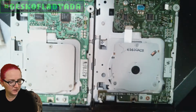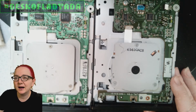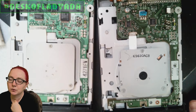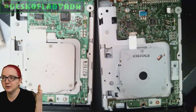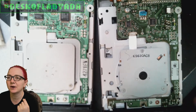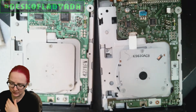The seller of this was like, no, I tested it in the computer. And I'm like, well, I believe you. But I would like to have this floppy drive supported. So what I'm going to have to do is find or get some computer with a floppy interface, and then verify it works. Just try inserting a disk and see if it boots. And if that works, then I should sniff it and see what signals the motherboard floppy controller is sending to get this going. I do know that the density and ready pins got recycled and reused between different drives.